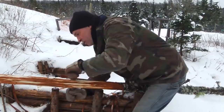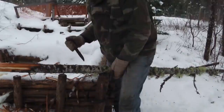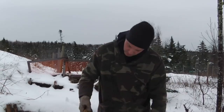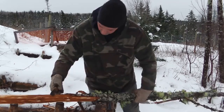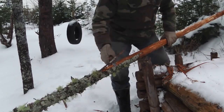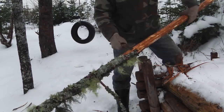Here I am just peeling the bark off this log. It's really easy to bark logs in the spring if they're a live tree. This is a dead tree, and when a dead tree is dry it's quite hard to bark them. But today we had a lot of snow and then the temperature rose to almost 5 degrees Celsius — it was kind of wet, a good thaw. So instead of the dead bark being frozen on, it was wet and easy to remove. I decided to use a knife instead of a draw knife — the ideal tool — or a spud bar for live trees.